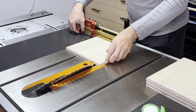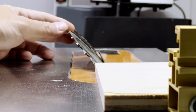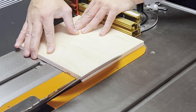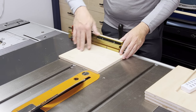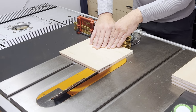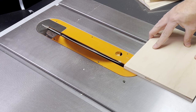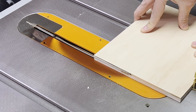After setting up the miter gauge on the right track, I set up the stop block to get a near-perfect cut at 45 degrees. Now there's four sides to a box, which means eight cuts, making sure we keep the show face always on top. Here you can see that I'm not cutting any portion of the show face — this will help with the continuous grain goal.